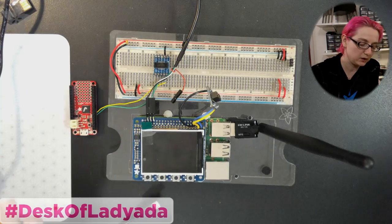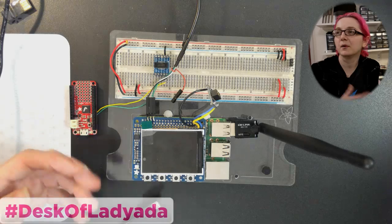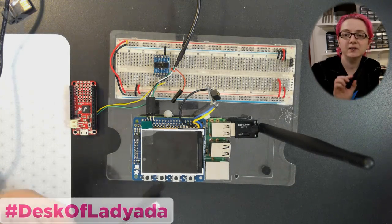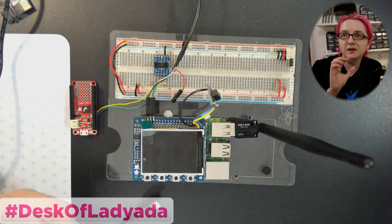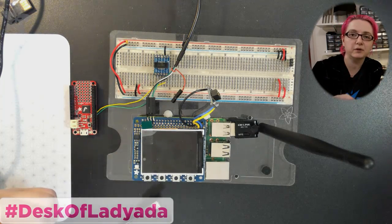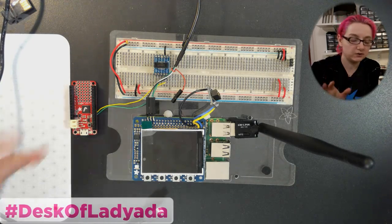Basically all these things that you would need to get your Pi in a good state, because I want to be able to duplicate this card for every PID, every product we make, and just tweak a few little things so that it's pretty much out of the box, ready to go. I just dump the new tester Python script in there, dupe the card, and then I put it in the boot directory as well. I'll show that all.